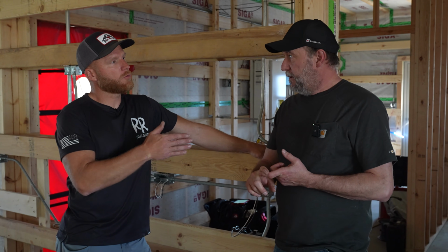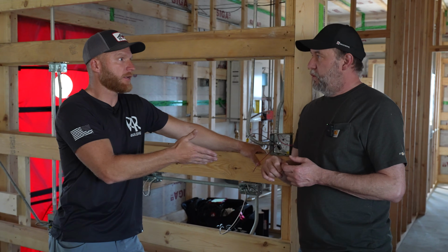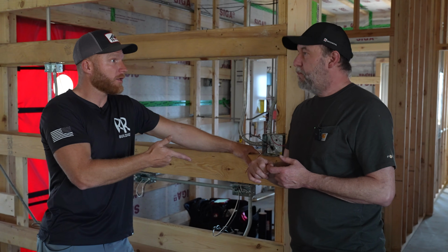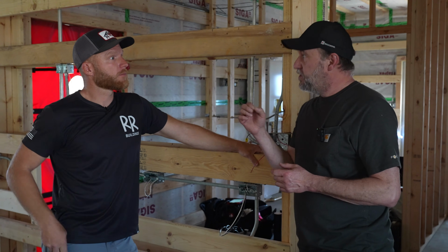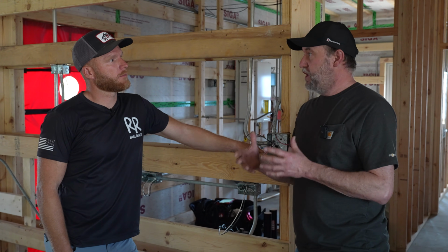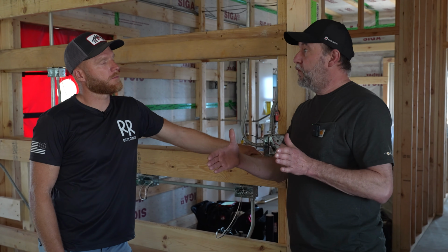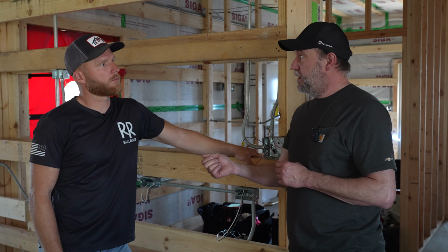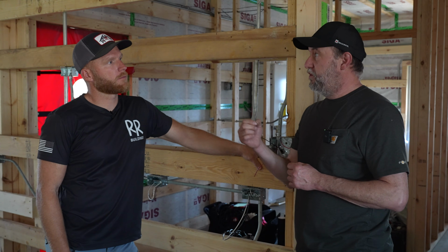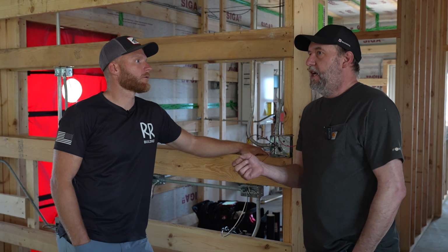Compare that to the barn door, where we had a lower ACH 50 number when you came down and did a test for us, which was .41 ACH. It's close, but just a little bit less leaky as far as the air changes per hour metric. But as far as the square footage of surface area, you actually got a better score, because that one was, if I remember right, .038, and this one is .022.